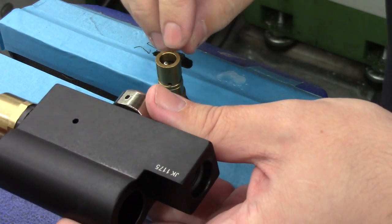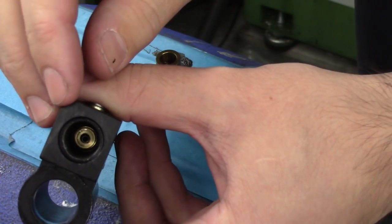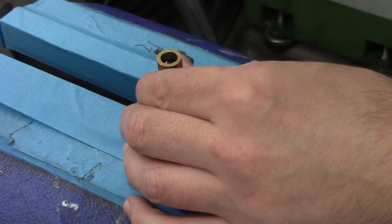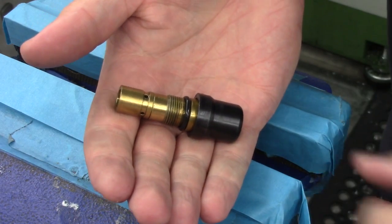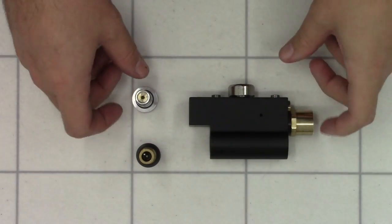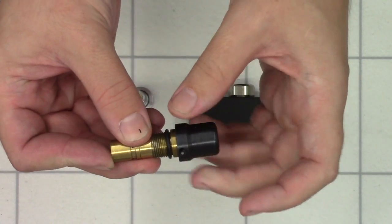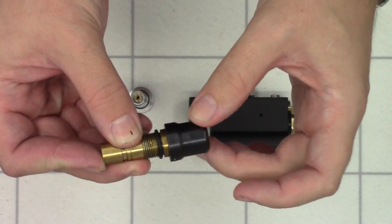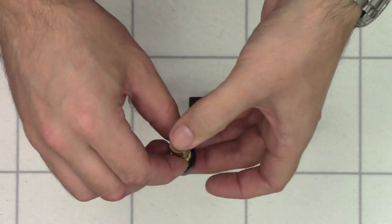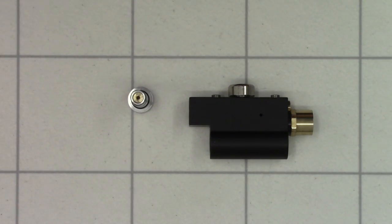Being nice and careful as there is a ball bearing in the end here, and also a spring in the end of the block. That's the standard R10 regulator removed without actually having to remove the end cap. Back over at the bench, the old regulator is fully removed — we didn't need to take this anti-tamper cover cap off. We're going to be needing no parts from this regulator; it's just a straight swap so we can put this to one side.